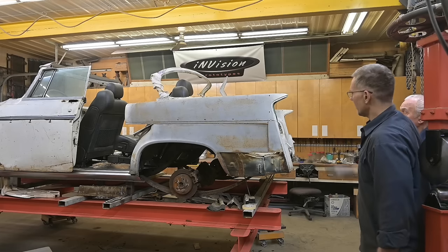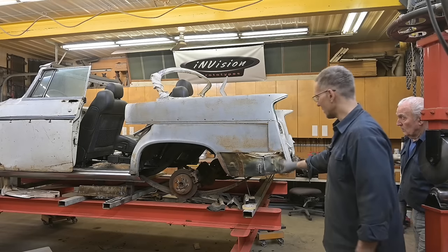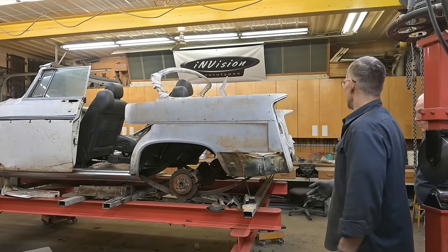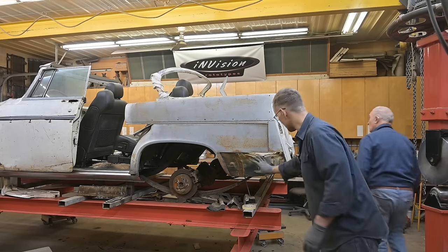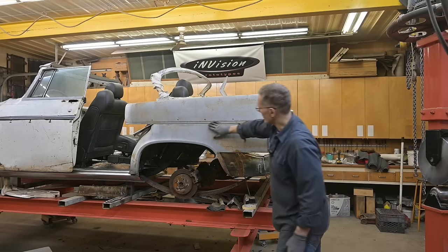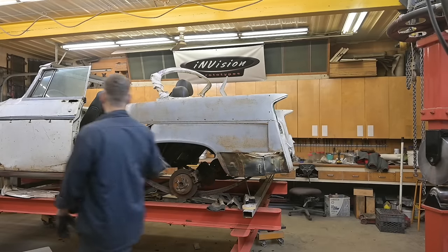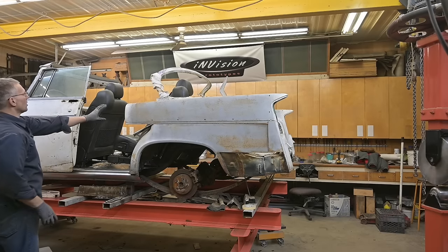But anyway, everything's lined up. This is all original sheet metal. A lot of this is going to be redone, cleaned up. There's a bunch of patchwork that was done here. Don't need that because it's just metal over metal, and you saw how that turned out. So we needed something to go by, and this helped us align the back sections together. The fin, that's all going to join up through here. This is a factory joint that they created, so we cut just below that. And up front here, this fin is going to extend probably into the door a bit.